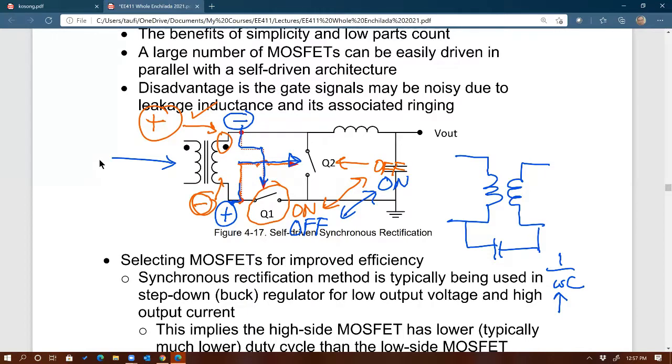In RF, gigahertz stuff. But even in power electronics, as you are increasing switching frequency, that omega increases, that would introduce leakage current between the primary side to the secondary side and vice versa through that capacitance. And the effect can also be in terms of resonance. So if that L is coupled with your leakage inductance, then it creates spikes, creates resonant ringing on the primary side, which is then reflected on the secondary side. So all kinds of noise problems if you are using this method.